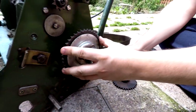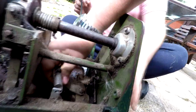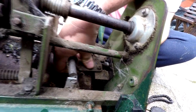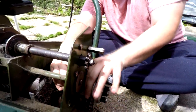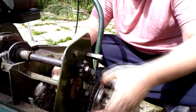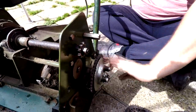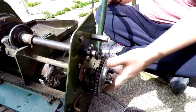So that goes through there. There's a bracket on the back of it — the bracket's got to come up there. Lift that bracket up, pull it back through, go ahead and whack it through there. Then that nut's got to go on there as well. Turn it by hand. So when you lift that handle up there, you're able to turn that sprocket — that releases the clutch. When you let go of it, the sprocket clutch turns the whole thing off. So that's what wasn't happening before.